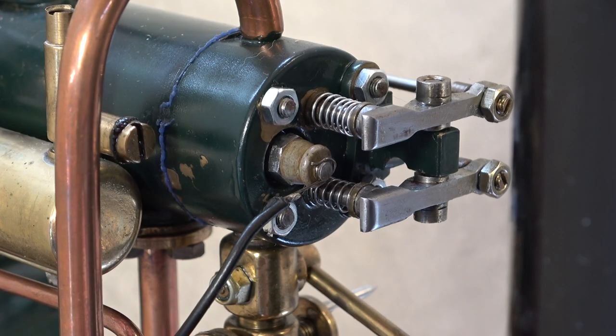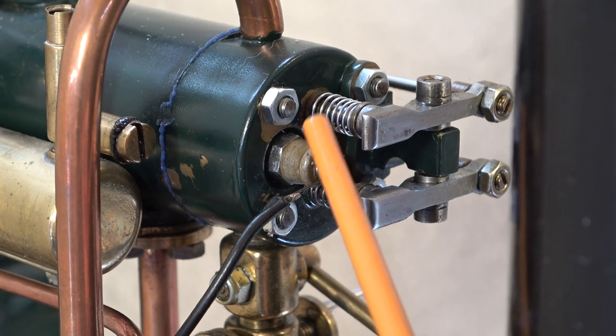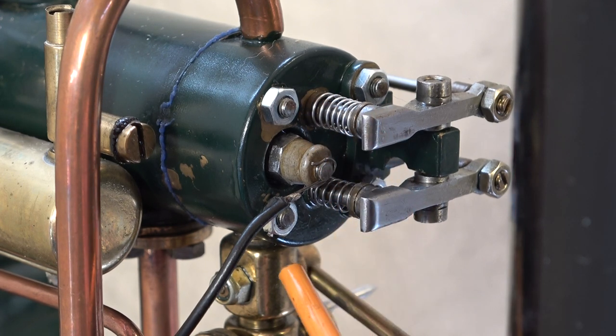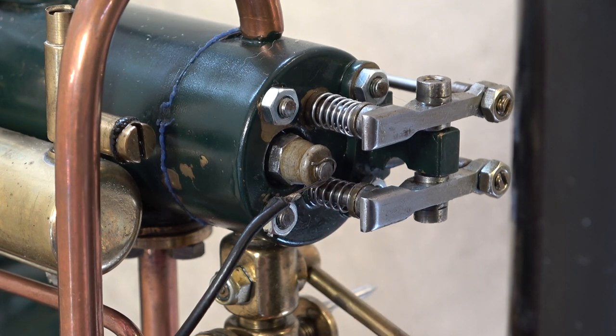And yet another comparison between the two engines: the old Crossley engine did not have high tension or low tension ignition. It had hot tube ignition with a burner — often a gas burner — to heat the hot tube all the time the engine was running.